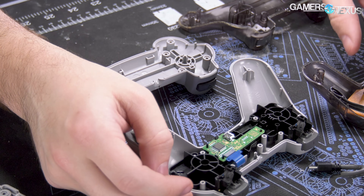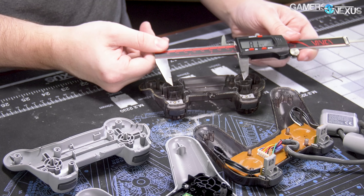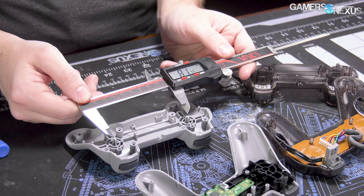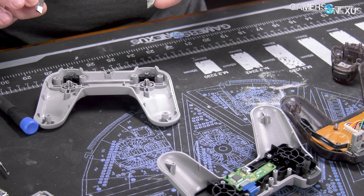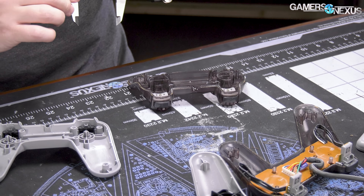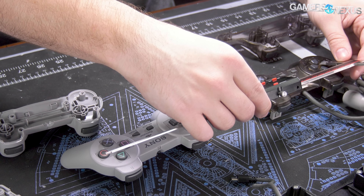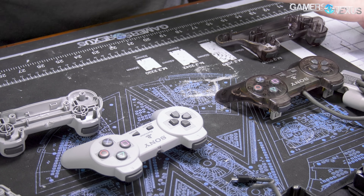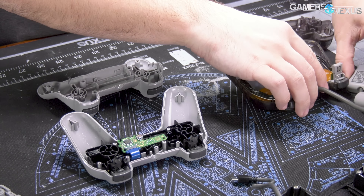A lot of that is getting rid of this massive, unnecessary PCB. For measurements: center to center is about 81.7mm, plus or minus one. The base of L and R is at 110.44. Both controllers measure out to about 81.4mm — so let's go ahead and call it and say the new controller is a more or less exact replica in terms of distance and size. That's true to spirit.